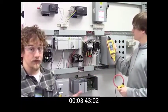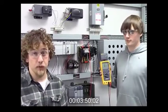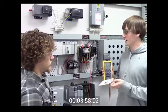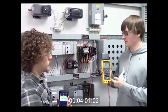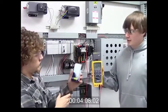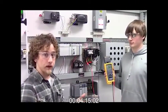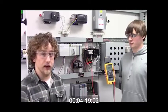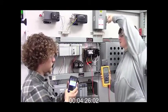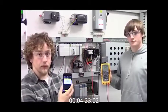So what that tells us is that we've lost the phase. We're going to have to take a couple more measurements to see why that's happening. Our next step in the troubleshooting process is to verify incoming power and that our fuses are good — we're mostly concerned with L2. I've already made the electrical connections after following our lockout-tagout procedure. I've verified that our meter is working and we're synced up to our smartphone. We energize the motor and we see that we are reading the appropriate 240 volts. Next step is to verify the output of the starter to make sure the load contacts are working. I've already made my electrical connections and we synced up to the smartphone, so all that's left is to energize the motor starter and start the motor. We're getting the appropriate 240 volts.